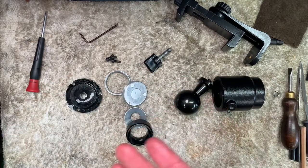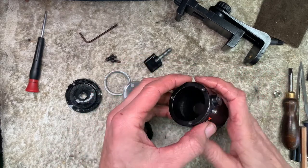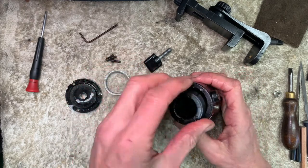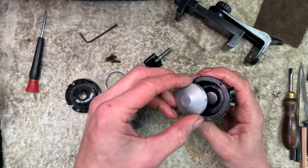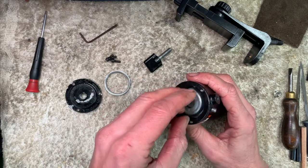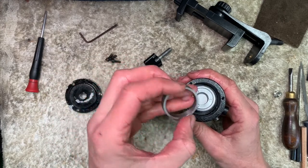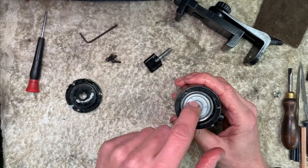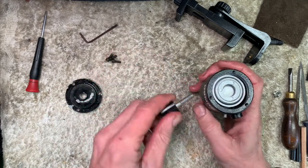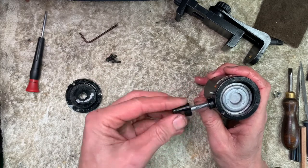This is the order of play in your Benbo. Ball goes in. Little plasticky cup washer goes on top. Then an upside down cone. Then this cone, that's how it came. And this is the part I've made. It's going to slip over their cone and just allow a little movement. Not much. And I wonder if that'll be enough. I don't know.